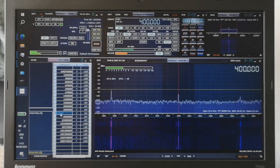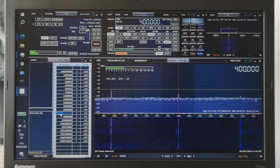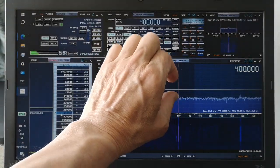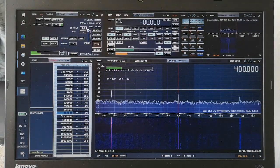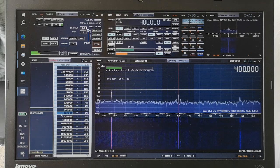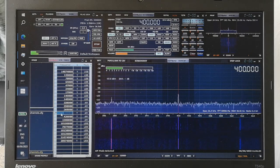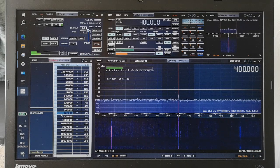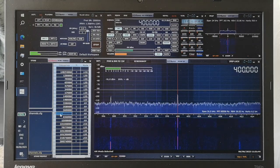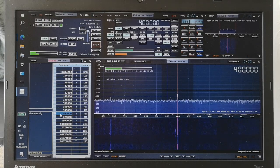I've been comparing this MiniWhip to a random piece of wire on the balcony. Although the wire sometimes receives higher signal levels, the noise level is about 20 dB higher, giving a much lower signal-to-noise ratio — that's what's important, the difference between signal and noise. The MiniWhip is better. The noise floor is at minus 115 dB. If I move the jumper to the isolated position, you can see the noise drops already — the noise floor is now at minus 120 dB, and the buzz has dropped by about 10 dB just by changing that jumper.